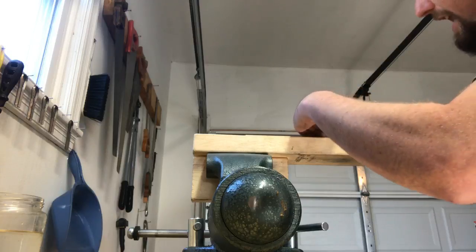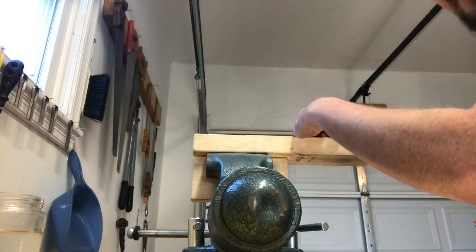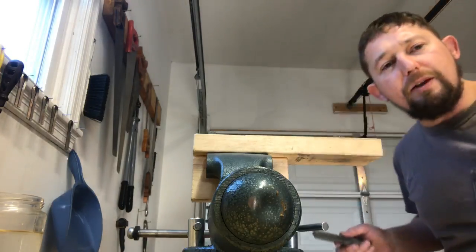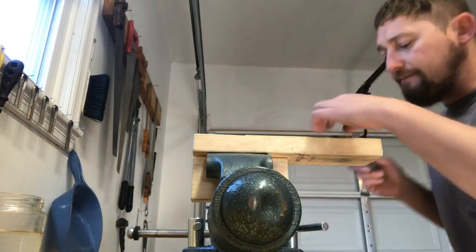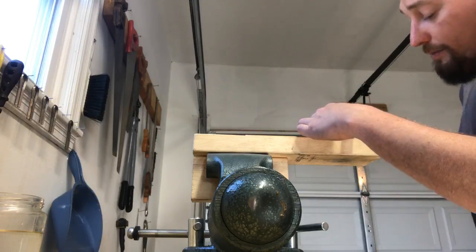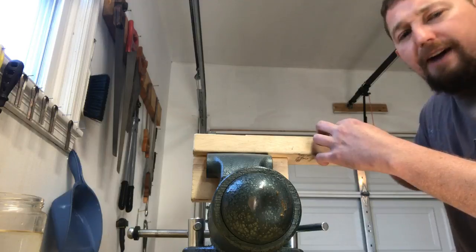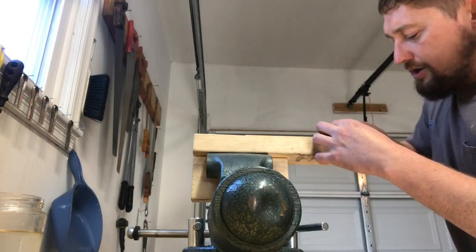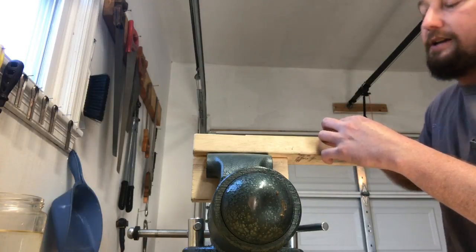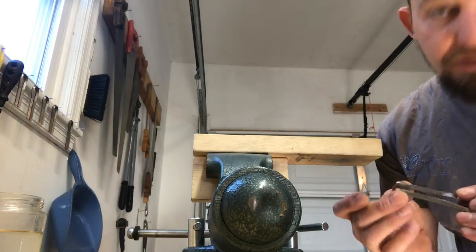We're just polishing that edge and polishing that burr back off because I want it to be a fine edge. I don't want it to be a toothy edge. Toothy edges, if you look at them under a microscope, look hairy and that makes for a hairy, fuzzy sound. If you look at it under a powerful enough microscope or magnifying glass, you're going to see that it still has a fine burr on it. The finer the burr, the better, to a certain extent. You don't have to go to a super high level of polish, but you don't want a rough edge. Yeah, it's polished out nicely.